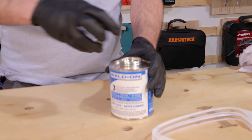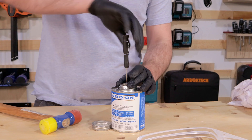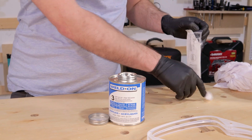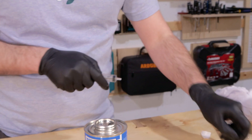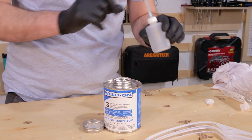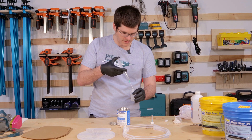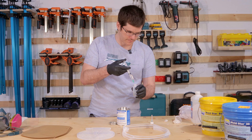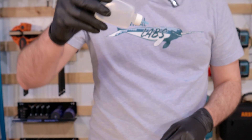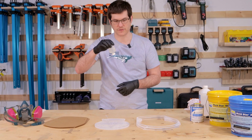I'm going to show you how I open these cans to make it a little easier to get this solvent out. I puncture a small hole in the top here, which also makes it last longer because it doesn't evaporate nearly as quickly. Then I use a luer lock syringe with a small needle, and we'll be putting it in one of these tinier dropper bottles. You don't really want to fill this more than halfway up — we only fill it halfway so that we can create a vacuum in this bottle. I squeeze the air out, and then when I turn it upside down we're not leaking any of the fluid. This makes it really easy to glue without getting any of this solvent on your acrylic where you do not want it.